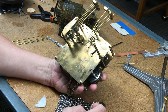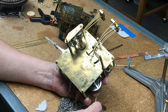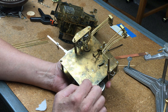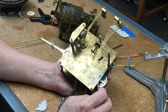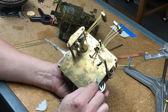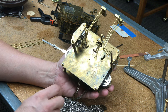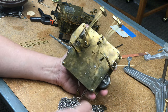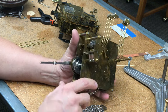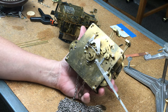This one's pretty dirty and it's really worn out. This will not be used anymore. Somebody rebuilt this along the way and they also cleaned it with an ammoniated cleaner, which I don't personally do, because it discolors the brass, cuts the lacquer, and strips the old lacquer off — and that can get down into the pivot holes.